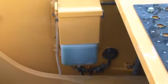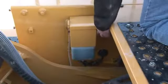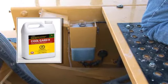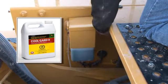Nearby is the radiator coolant bottle. With the engine cold, the coolant level should be between the full and low marks. Note, on the 470 you can also view the level from the cab. If low, coolant can be added to the bottle. Access is gained by flipping open the metal cover. Fill with a mixture of clean, soft water and a permanent type low silicate ethylene glycol base antifreeze.